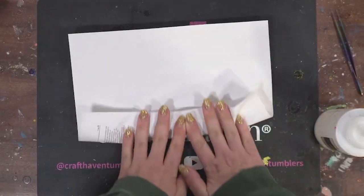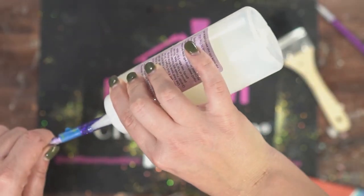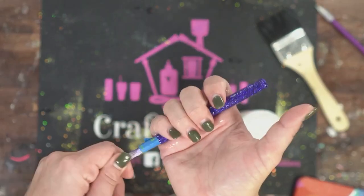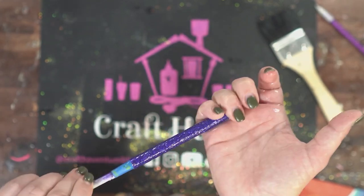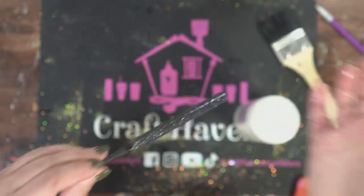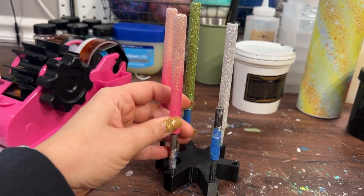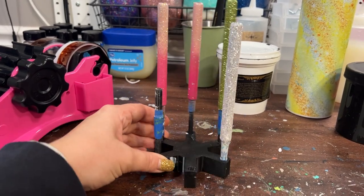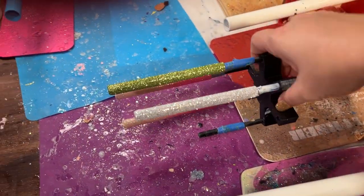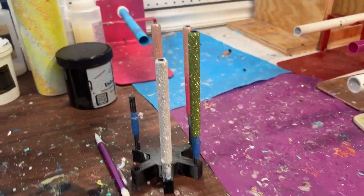After that two-hour dry time, you can flatten it with paper — I'm using literal copy paper or you can use parchment paper — to make sure it's nice and flat. Then you're going to add your Grand Finale to get that smooth surface. You can use your hand or a brush, but it's definitely easier to have your pen attached to something. In this case it's a rod for my adapter, and you're going to apply three or four coats of Grand Finale, letting each coat dry for two hours. You don't have to put your pens on a cup turner — you can have them sit as-is, but make sure you're not getting any pooling on the bottom. You may need painter's tape to hold them steady since pens aren't all the same size, but I like to attach them to my turner so they can level out really easily.